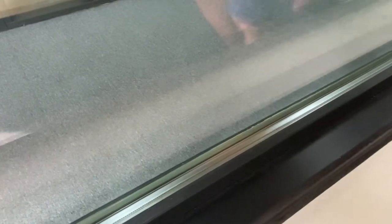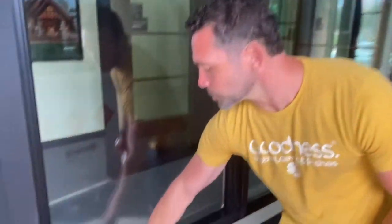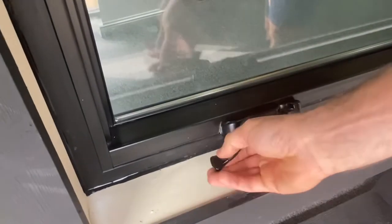Don't mind this caulk line — that's just a different level of sheen. What I want you to see is this really thin frame. Even inside the windows nowadays, they have a little silver strip you can see between the argon-filled glass. Today they provide the option of making that black, and Mark defaults to that on all our windows. So it's all very uniform. This is the inside — it's a casement. Casement windows are typically going to have a slightly thicker frame than fixed windows, so that's something to navigate when picking out windows.